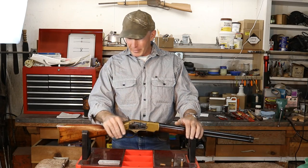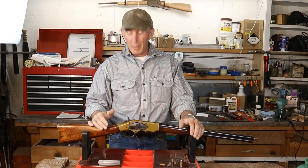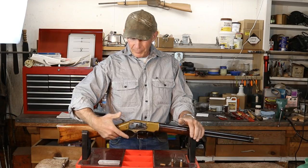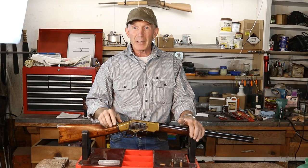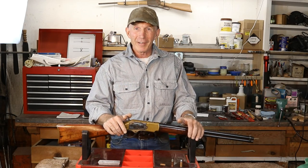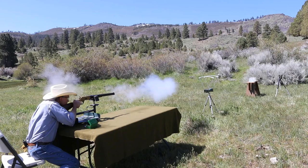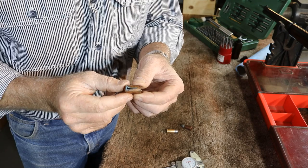We got everything done — it took quite a while — and took it out to test-fire a couple of our Henry reloads. We found a couple more problems. It had a kind of weak homemade mainspring, so the only way we could get it to fire was to pull the hammer back past full cock, pull the trigger, and get enough energy to fire. We've since replaced it with another mainspring, but that one was too powerful — we could hardly work the action. When we test-fired that cartridge, we got a little puff of smoke right out of the top of the receiver.